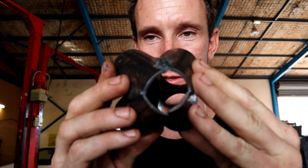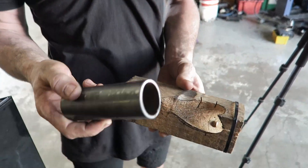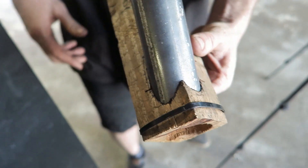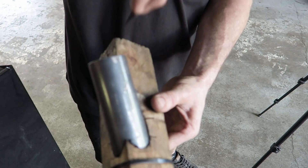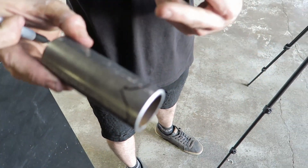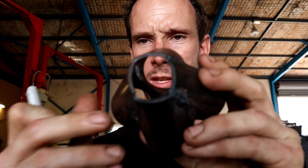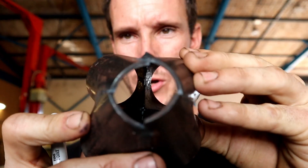About six months ago I designed a four-in-one collector used for turbo manifolds. The way I made it is with a block of wood with a piece of steam pipe — there's a screw so it goes in the same depth each time. After that we get the pen, mark it out, and cut that out with the angle grinder. Do that four times and we end up with this. It works great — the cuts inside all line up perfectly.